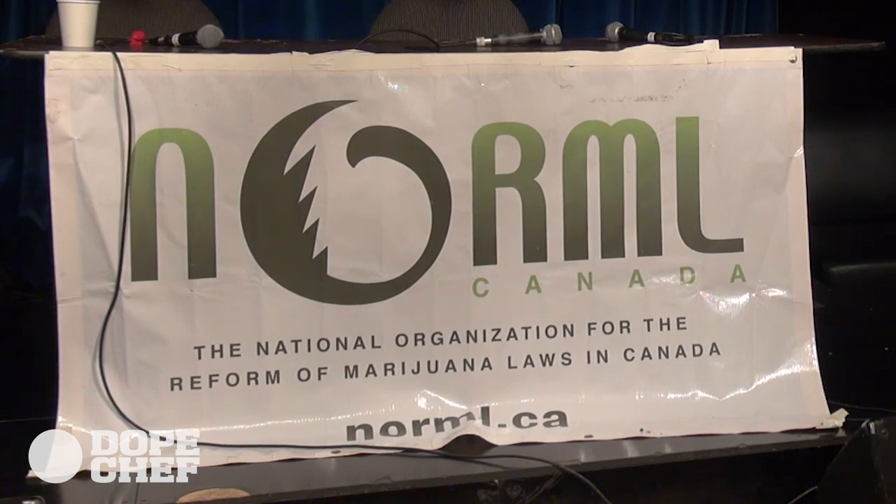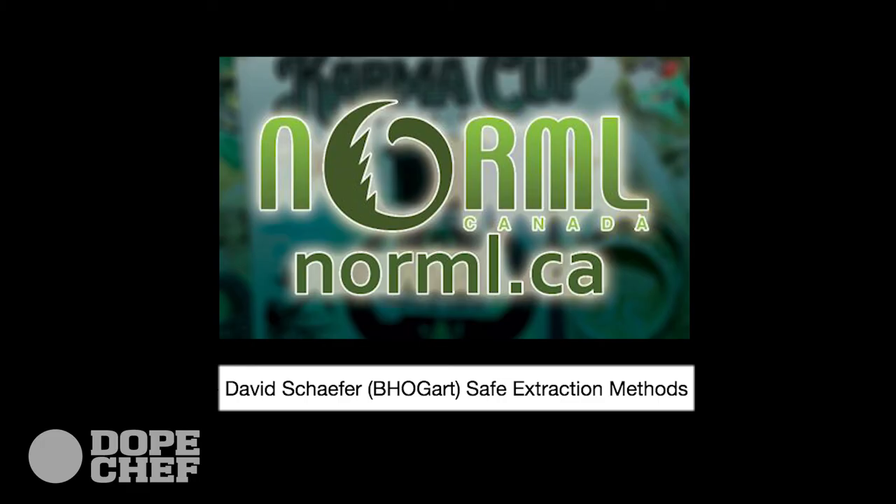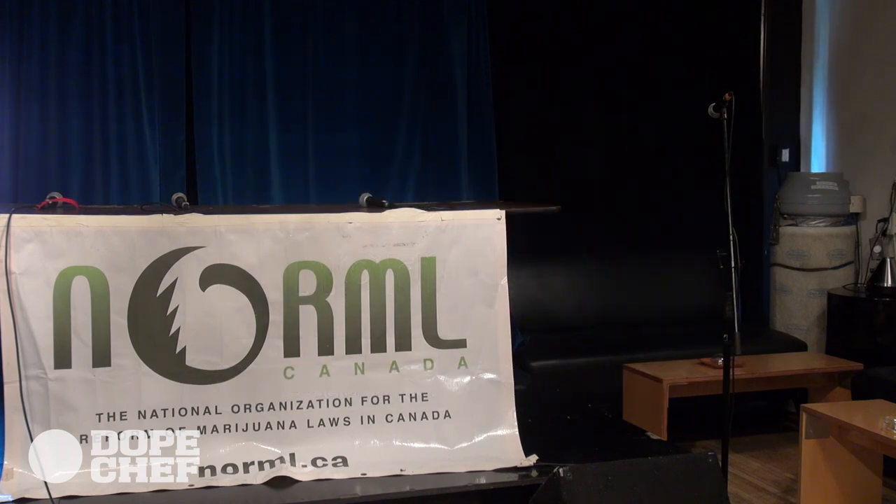When you wear personal protection equipment, you're creating an industry standard so that if anything happens, the extractor is protected. To review hydrocarbon extraction safety: one, the extractor, when built correctly, can handle the maximum pressure — that's what makes the extractor safe. Two, any potential leaks are taken care of by the room with proper ventilation — that makes the environment safe. And three, PPE keeps the extraction artist safe from things like cold hydrocarbons and gas in the air — gloves and non-synthetic clothing for worst-case scenarios.